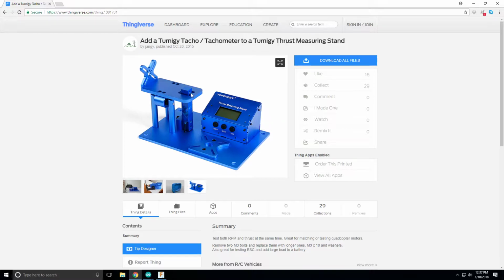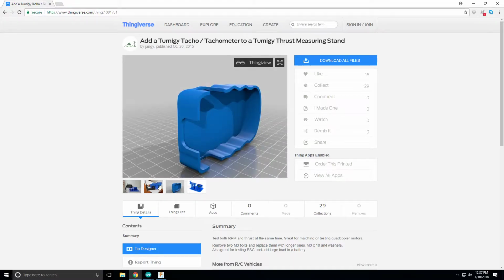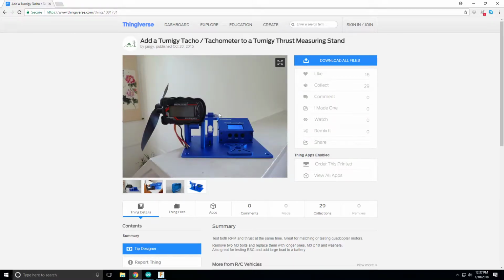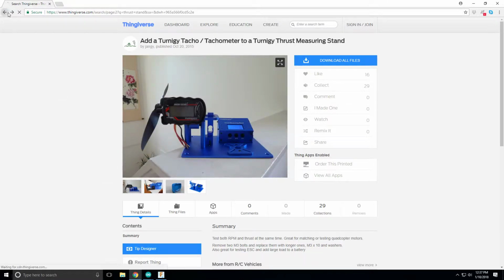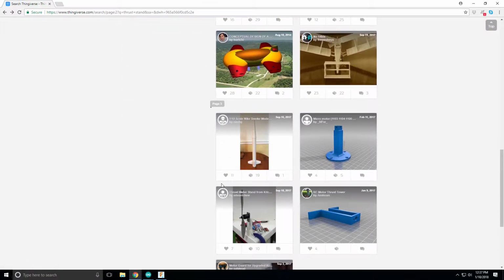So let's say if I push down on this steel about 50 grams, let's use 50 grams again, and let's say it deflects 0.1 millimeters. Right, 50 grams, 0.1 millimeters. Then let's say we look at what it says in the resistance, and it says it's 25 ohms. So 25 ohms is equal to 50 grams. You would use that to equate, and you do that through a whole bunch of testing, and then you get an equation from that to take that measurement. So here's the old school style. But what we're going to do is make use of a very accurate scale to measure what we need to measure.